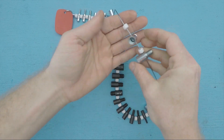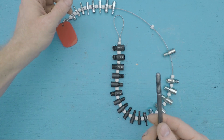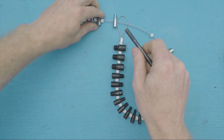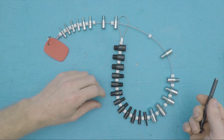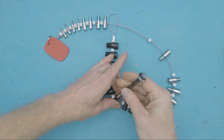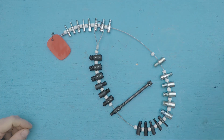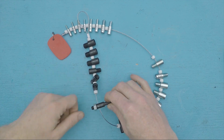So let's say the Fintuzler nut has fallen off my horseless telegraph, but fortunately I still have the bolt here, and it looks like about 5/16-18. No, maybe not. So maybe it's fine threaded? That'd be 5/16-24. Nope. So maybe it's metric. Here it is. I'll just replicate an M8 by 1.25 Fintuzler nut, and I should be good to go. And of course, had the genders been swapped here, I could have used the opposite end of this tester to measure the threads on this nut.